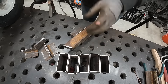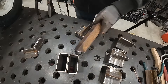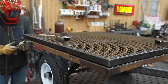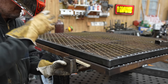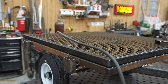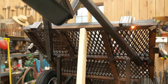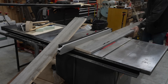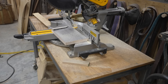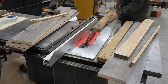I found this steel 2x4 and I'm cutting it — these are going to become the stake pockets that are going to be welded to the outside of the entire cart on three sides. I started to think of a clever way to put them on because they need to stand out a little bit so that the wood and bolts can clear the flipping ramp. I used these two-inch angle irons and also supported it from underneath. Later in the video I'm making the wooden sides — containment sides in case I want to put bushels of material in there — using some hemlock and a couple chunks of oak, all just what I had lying around.